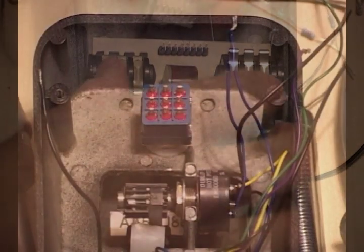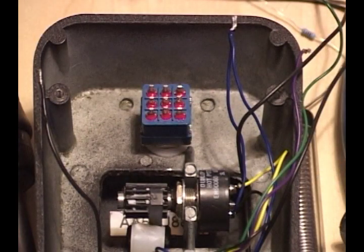Now you can put your PCB back into the pedal. Now we have to solder the wires onto the new switch. We will start with the clean input signal wire, which gets soldered onto the middle left terminal point. The green wire or circuit input gets soldered onto the top left terminal. The purple wire or clean output wire gets soldered onto the center terminal point. The blue wire or FX circuit output gets soldered onto the top center terminal. You will need to solder a small piece of wire to these two terminal points in order to create a jumper. Now take the wire which we put into the top part of the diode and run it to the top right terminal on the switch.